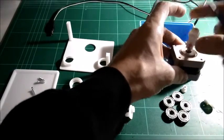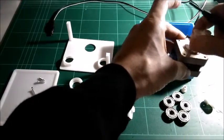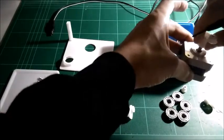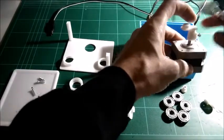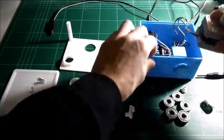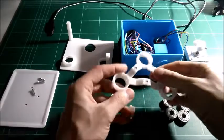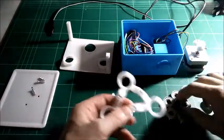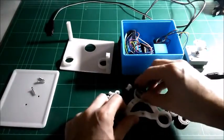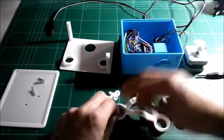Just make it pretty tight and test it. When you spin it you should feel the steps of the stepper motor — it shouldn't be smooth. You should be able to feel the steps, which means the shaft is actually being moved by the coupling. Okay, that's tight — put that aside for right now. Check out this support here; we're going to put the bearings in there.